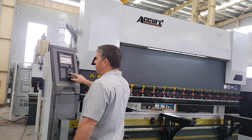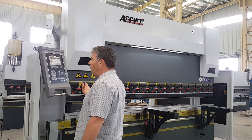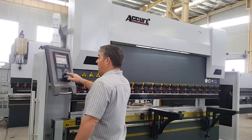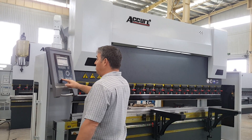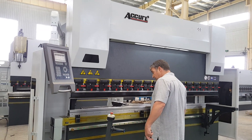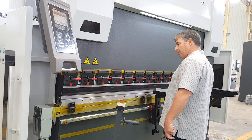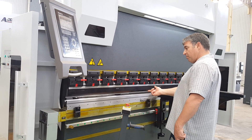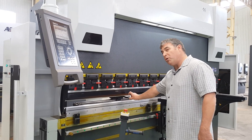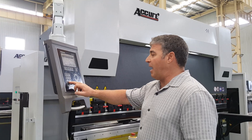Also comes with CNC crowning — that's another great feature. Also mute point and open height — those are all things I have control over. Right now I have the open height set up very high. If I didn't want it that high, I could do a two-inch open height. So after my bend, if I was doing clips or something that didn't need a lot of open height, there's my decompression, two-inch open height. Open height is the distance above the mute point of the speed change. If I were doing clips, obviously I would take my decompression out of there.